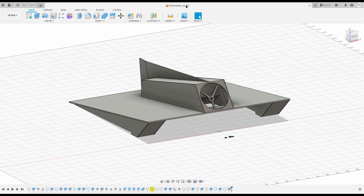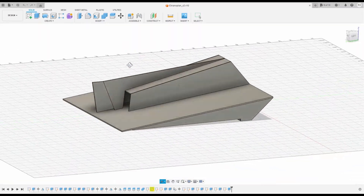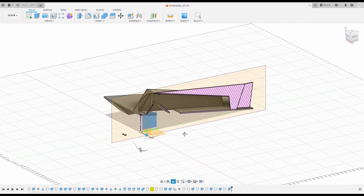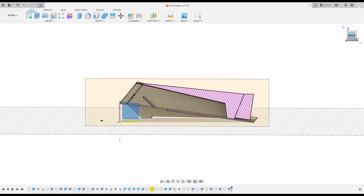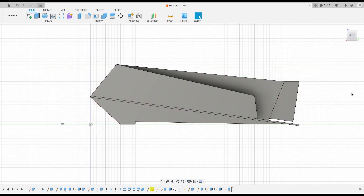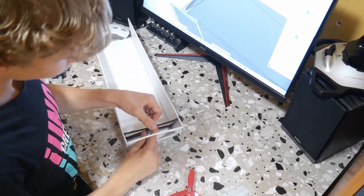But coming back to the ekranoplan V2 — I first made, in my opinion, a quite unique design, with a flap that was supposed to push more air at the start under the craft to make it easier to lift. After liftoff, this flap would switch to directing airflow behind, moving it forward. But it was pushing too much air on the front, flipping it after every launch. The channel was also limiting airflow, slowing the ekranoplan down. Maybe with an EDF fan and better air channeling this design can work, but after that unsuccessful attempt I chose to go with a more straightforward design, based on what I already have left from the flap design.